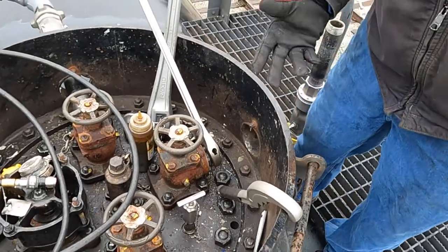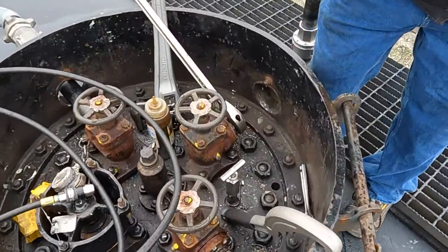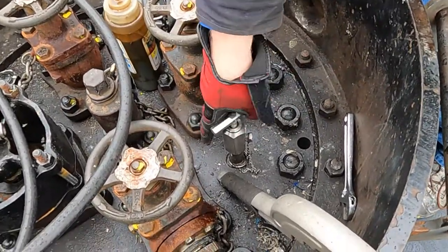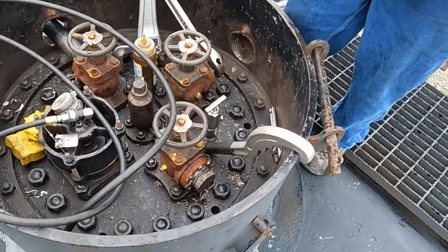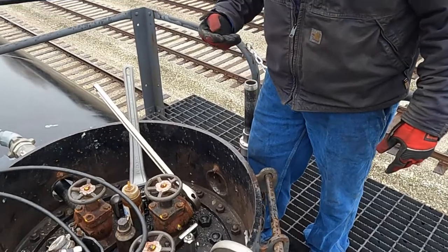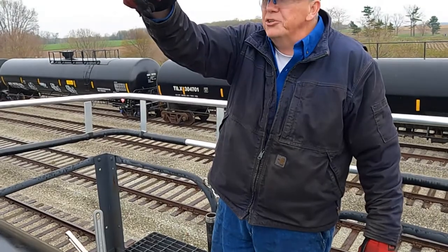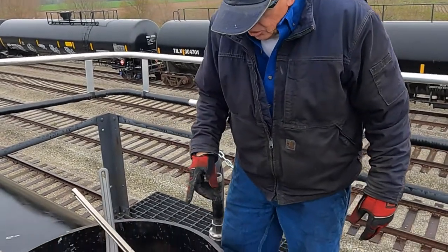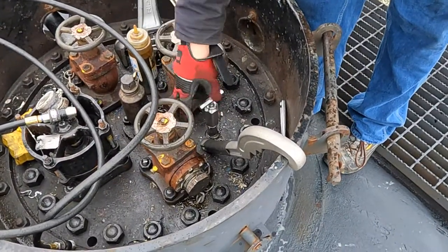When it comes to taking a final car pressure reading, take that lower pressure gauge that's sitting there in the toolbox, put it in here, then open this up, and that pressure gauge is what will tell you. That's the pressure that you document as far as what your finished car pressure was. We don't rely just on what the pressure gauge at the compressor says, and we don't rely on what that big pressure gauge up at the actuator says — we rely on that. So when you're done, pull your gauge out, tighten this by hand.